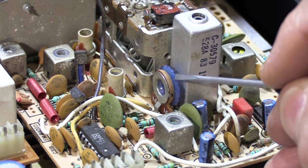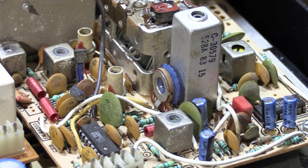So now we have it turned all the way in the other direction, so we have no squelch. It will try to receive every single weak station in the world. It will receive strong stations. If the stations are too strong, they may sound distorted. You will get infinite static in between everything, and it will be equally as unusable. What you usually want is something in the mid-range of this.